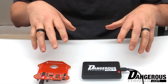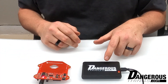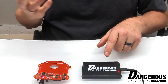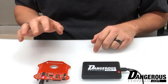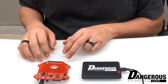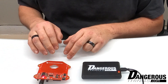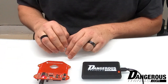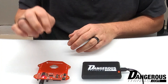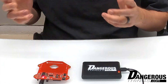We have two readers here. This is the KBR1 — it reads MIFARE Classic, NFC 13.56 MHz, ISO 14443A type chips, so the Magic MIFARE chip is perfect for it. This other reader I have just a few left of — it's no longer made anymore, but I really like it. It's a low frequency reader that reads EM chips and EM Mode T5577s. It's a really nice reader with a nice antenna and some logic built in. They're out of business and don't make them anymore.